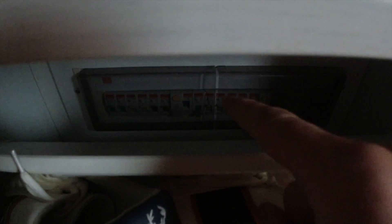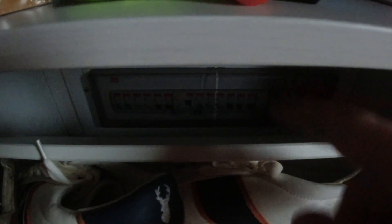I've turned that off. You can definitely lock that off if someone's going to re-energize it - lock it off and turn it off. I'm going to shut that in that cabinet and I'm the only one in the house. The circuit's off and now you've proven dead.